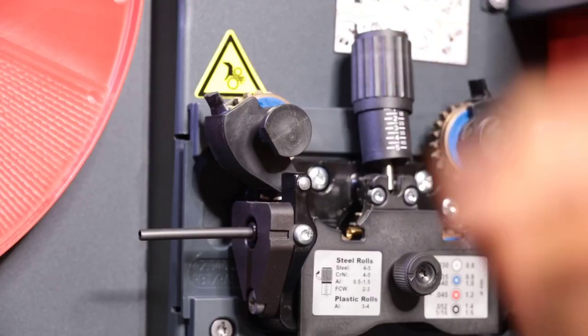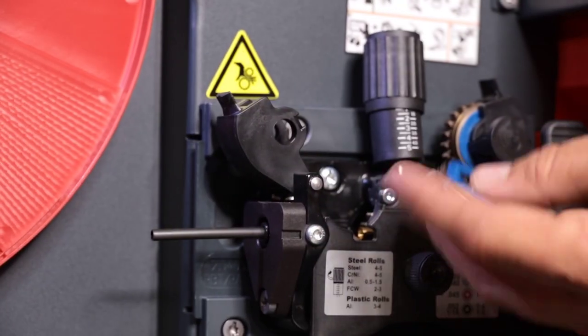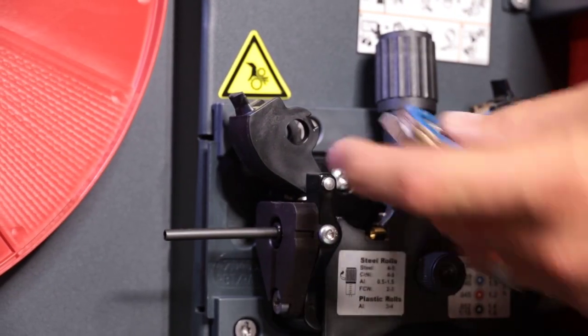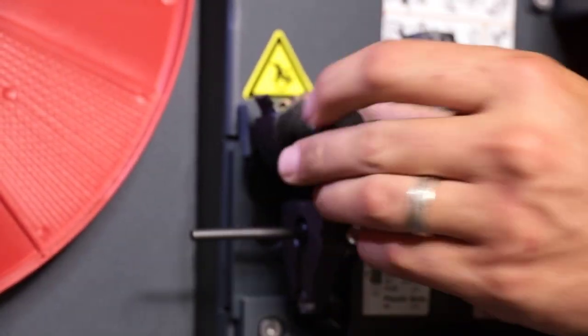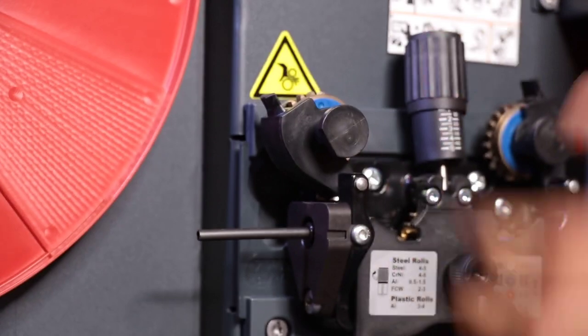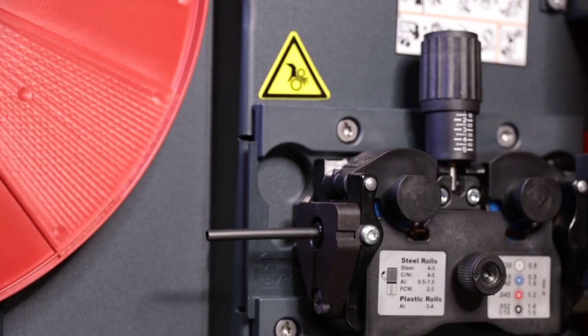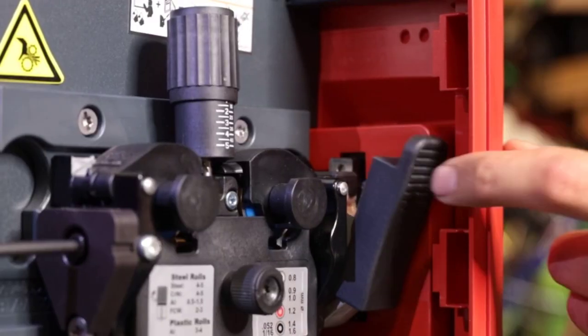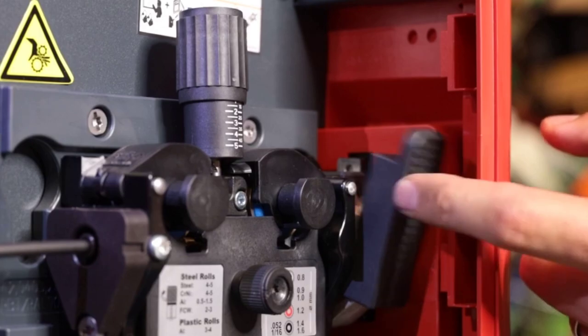Here you can adjust. What I like about the drive wheels is they're an enclosed bearing, so you're not going to have grease and contaminants coming out on the welding wire. And the other thing, you don't need two hands with this system. You can just drop it, engage the rollers, lock it in. The other thing I like about it is this Fronius system connector clamp. You can have 400 pounds of direct force.